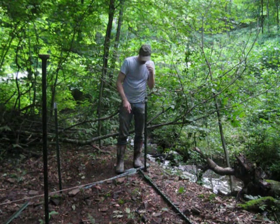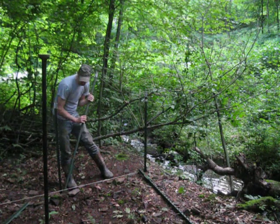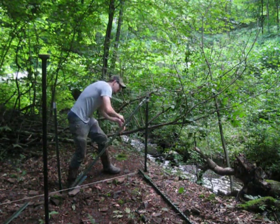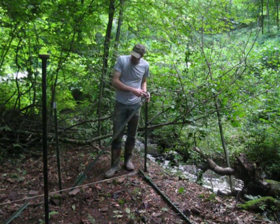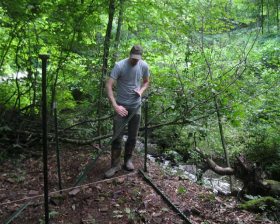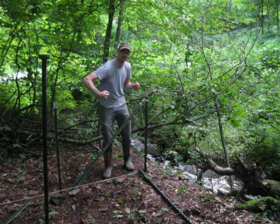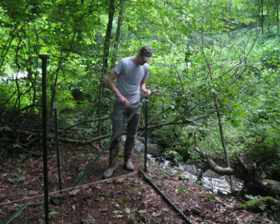So now you've got to put the actual brace on. You just pop it in the hole at the lower socket, then bring it in and pop it in the top socket. Boom! That's it. So you're going to have this tensioned this way and this way. This brace will keep the top of this post from going this way because it'll be pushing against it. When you tension it with cables, you're going to pull the brace this way — the tension and compression are going to cancel out and this should be nice and sturdy.